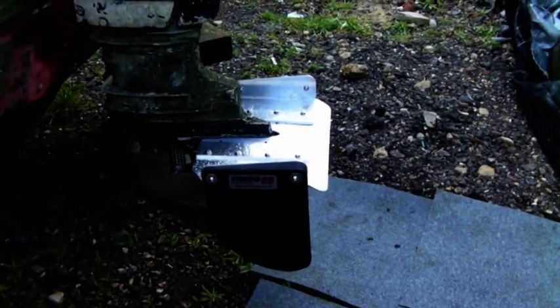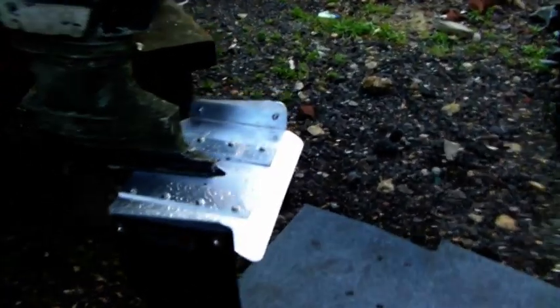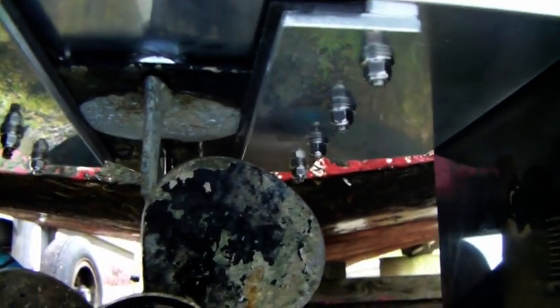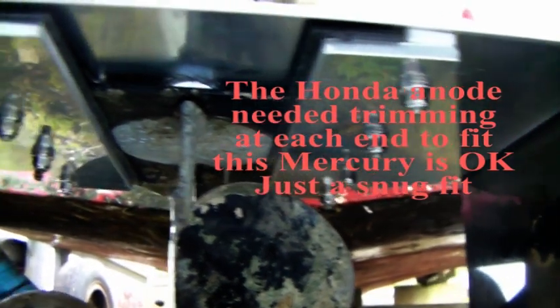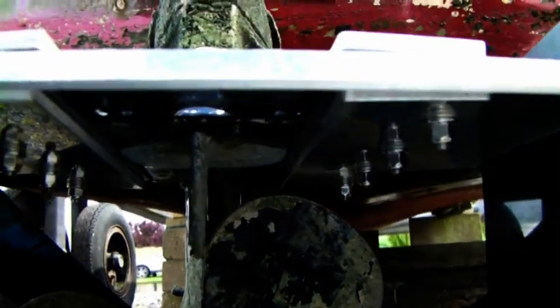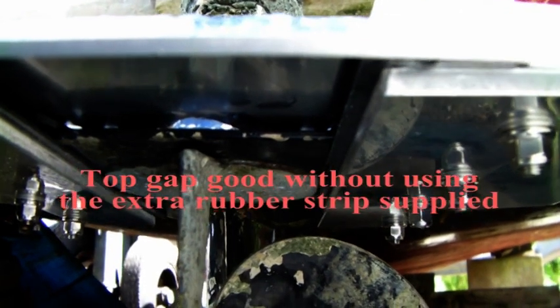Just want to give you a quick look underneath because we mentioned the anode and the fin underneath. Underneath we have an anode-come-fin, and as you can see the plates either side at the furthest out bolt setting have worked out just nicely, with a slight curl to the rubber lip. Turning the propeller — you can see there's adequate clearance at the top. Moving the camera up — the location is really good.